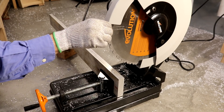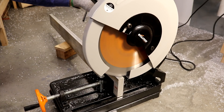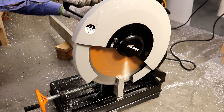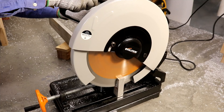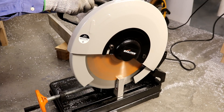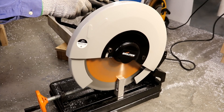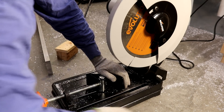After checking to make certain all the teeth are cleared of packed aluminum chips, I'm going to make the same cut that just took about 20 seconds on the DeWalt saw using the Rage 2 saw. Because of the design of the Rage 2 blade — with half the lobes having teeth and the other half not — we might expect the Rage 2 saw to take roughly twice as long. The saw is shuddering quite a bit now and there are few chips being thrown out the front, so I'm pretty sure all the teeth are packed with aluminum. And that was the circuit breaker tripping. The Rage 2 saw with the blade it comes with is unusable for thicker aluminum stock.